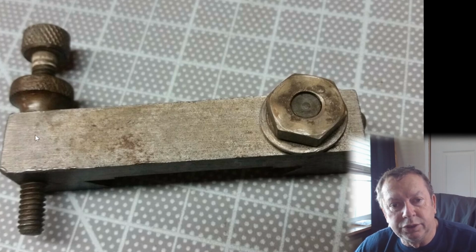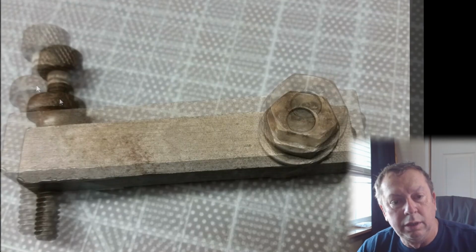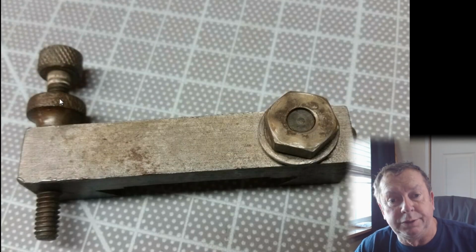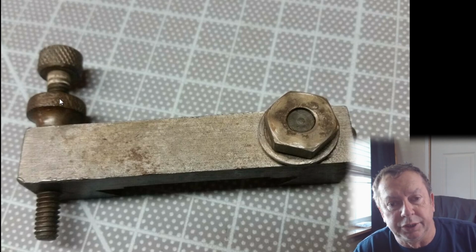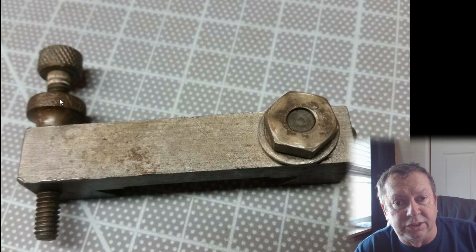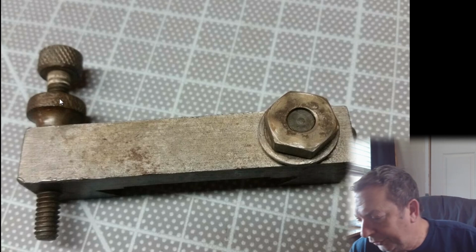We've got a quarter 20 screw going through it. I know it's a quarter 20 because that's primarily what Atlas uses in all of these. This is the standard knurled nut that they use on several things. One of them is the Atlas's multi-stop, which is the apron stop used with the production machines. I started cutting patterns for these the other day, but I haven't finished them yet. Got working on other patterns for right now, but that's the same knurled nut that goes on there.